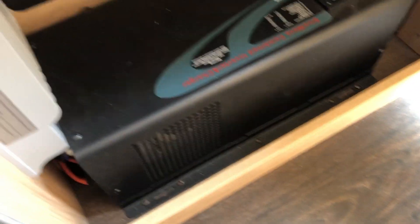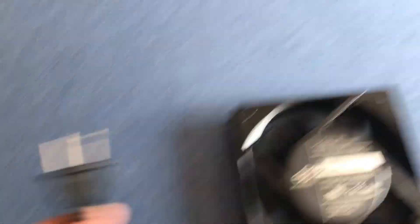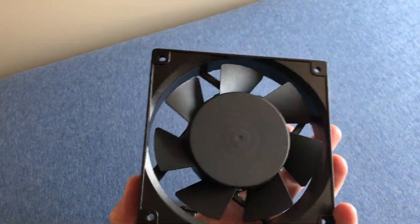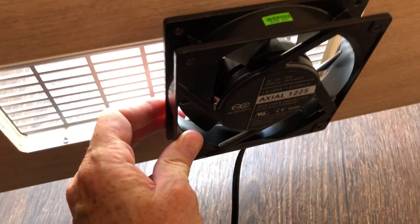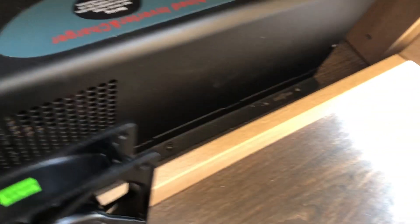So what I'm going to do is install an additional fan. We have a 120-volt fan — I'll post a link to the one I bought on Amazon. It's a very quiet fan and moves a decent amount of air. What we'll do is mount this fan over the door. It does have a grate to cover the backside of the fan for protection, and there's enough space between the inverter and the door for it to sit. It's going to pull air out of the inverter and exhaust it out the door.